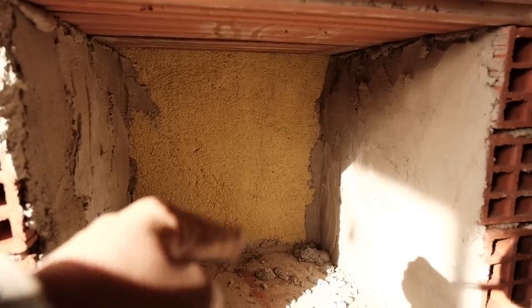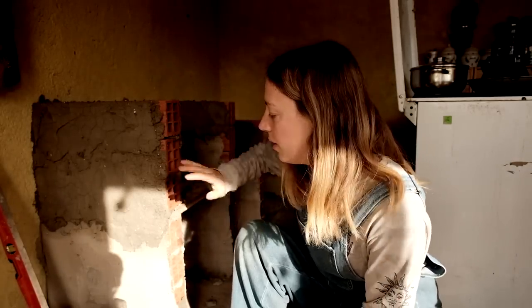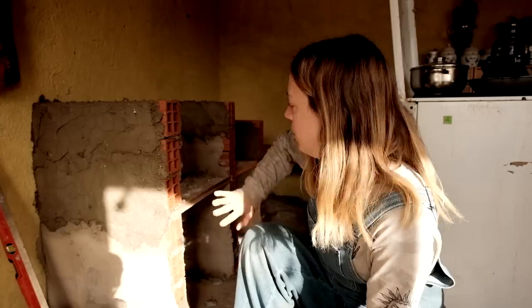Today I was going to carry on just putting the surfaces on here and building it up, but I've just realised that what I forgot to do, which I did last time, which worked quite well, was plaster the wall behind, like underneath, before doing the shelves, because it's kind of awkward to get in there once you've got the shelves and the top on. So before I go any further, I'm going to do that, and I think I'm going to just basically plaster the back of this whole wall and the back of the inside of the shelves.